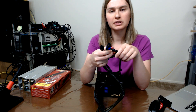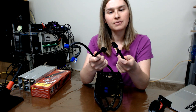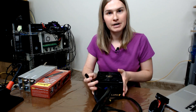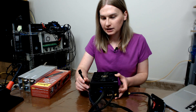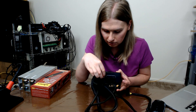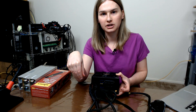If you guys aren't familiar with JBOD, it's just a bunch of discs — and my internal unit I'm calling the JBOD today. The other reason why I like the idea of cutting these off is that I can take this 2x4 Molex connector and reuse it to tap into the grounds. I'm going to need 15 grounds and I'm going to need 9 five volts. I also really like this power supply option because it has these clips on it, and I'm just going to be cutting these off. These clips can go right back into the outputs on the PSU so that I can get more power out of the unit without destroying extra cables.